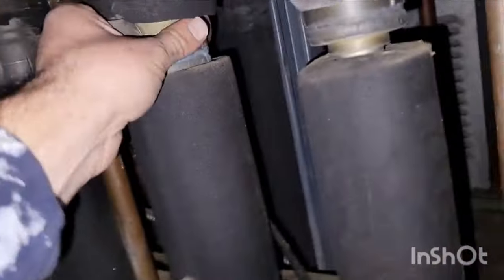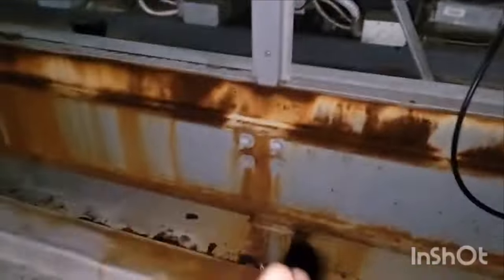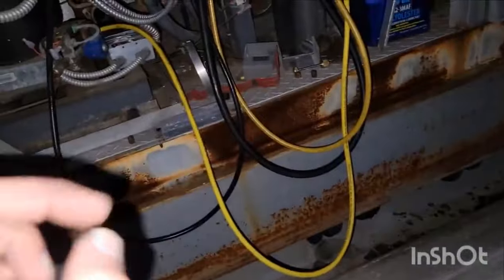If you find that your suction header is super hot, check everything back from the cases and then go back to your compressors, and then, unfortunately, you gotta start isolating them and try to figure out what compressor's causing it. But anyway, we'll get more into that with the pen and paper. Hopefully I explained that decently.